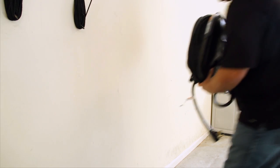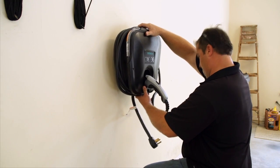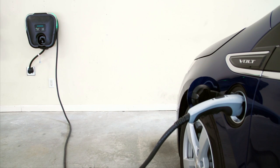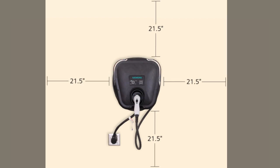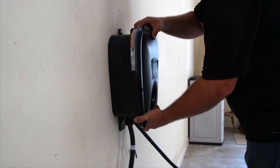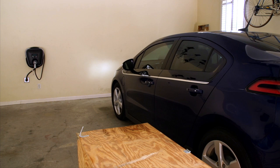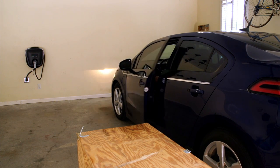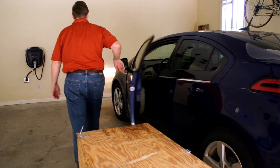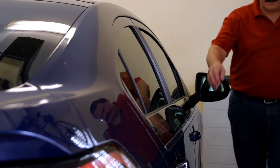Select a mounting site close to the charging connection of the vehicle. Make sure the 20-foot cord will reach to the charge port. You will want to allow 21.5 inches minimum clearance for the connector between the wall and anything in the area. The VersaCharge mounts on the surface of the wall. You should choose a location where there is sufficient space to park a vehicle, walk past the device, and open nearby doors without obstruction.